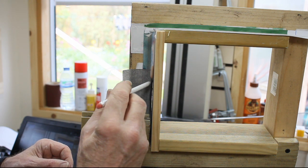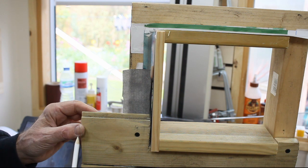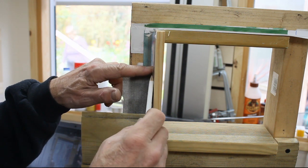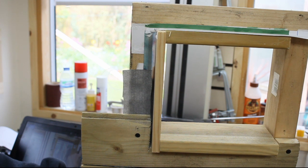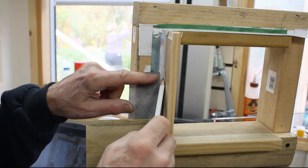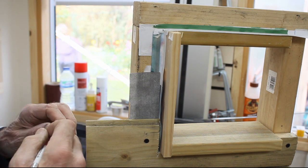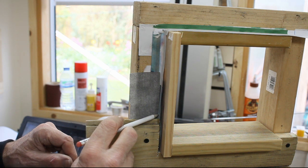And the problem with that is, of course, that if you don't do anything else, you've got more or less a clear path through the side for water to get straight in, and it seeps straight through and comes out on the inside. So what I've done is I lined that inner panel with a flash band, which is effectively a self-adhesive sticky bitumen strip that I put all the way down the edges, and wherever there's a joint or a lap, you take the top one over the bottom one so that any water that hits it will go down rather than inside.